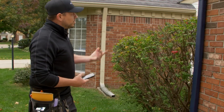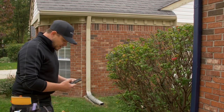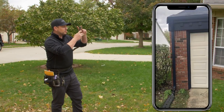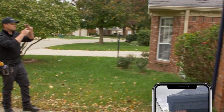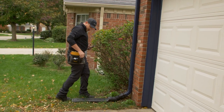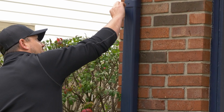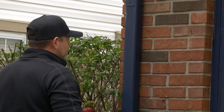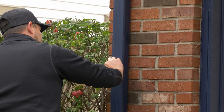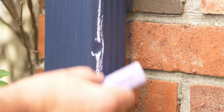First thing I'm going to look at here is the gutter. I do see some dings on this gutter from hail. I'm not going to just get up and take a close-up of that damage — I want to show where that gutter is located: is it one story, two story, where's it at on the house? I'm going to move up here and mark some damage, placing the chalk flat on the dent and rubbing it across.